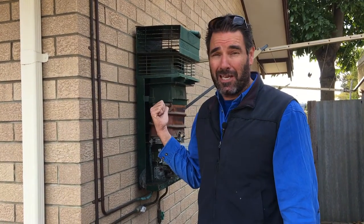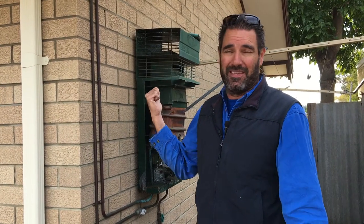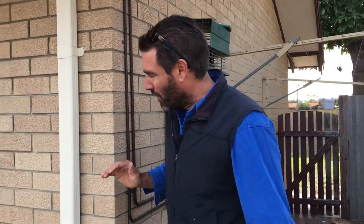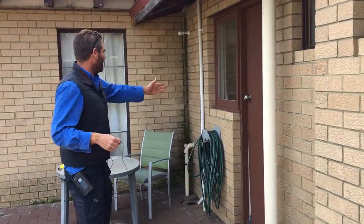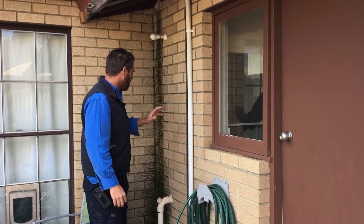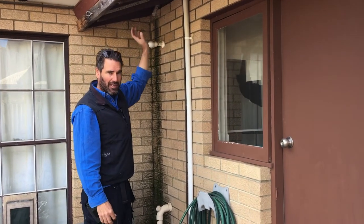It's not going to work efficiently anyway. I said let's take a step back and think about something you know, because whatever you choose you're going to be stuck with for the next 10 years. If you put exactly the same thing in here and the gas fitter doesn't test it or measure the burner pressure, you're going to be stuck with stuff that's not working correctly and you'll never know. I said look, it's undersized — and look at the position. We've got a whole bedroom, then the bathroom over here, then the laundry, and the kitchen's just on the other side of that wall.